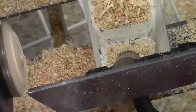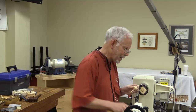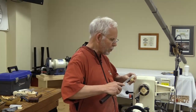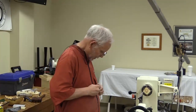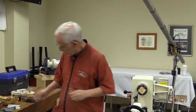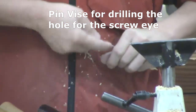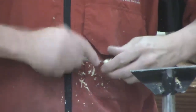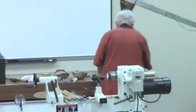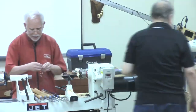One of the things I've found over the years is that in parting these, if you can actually do it not to where it's just coming to a point, but actually with a little bit of a flat spot on the end, it serves you well because you're going to actually come in and make a little bit of a hole and then with your tool — yeah, just a little bit of a flat there.